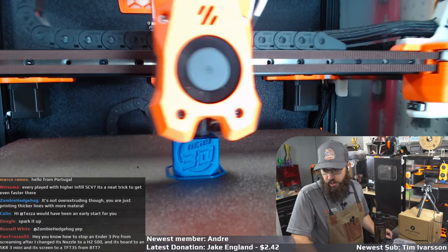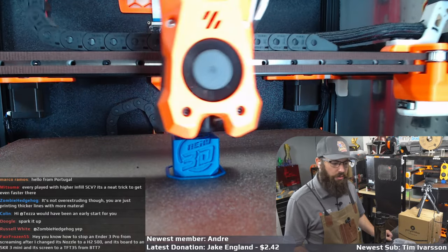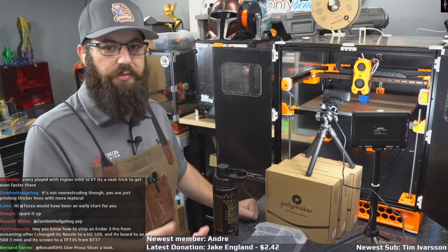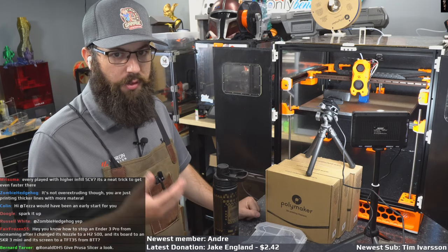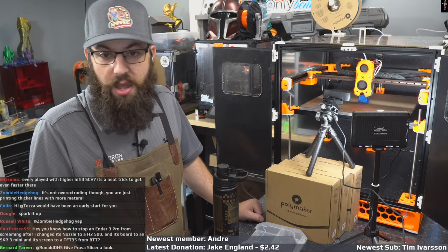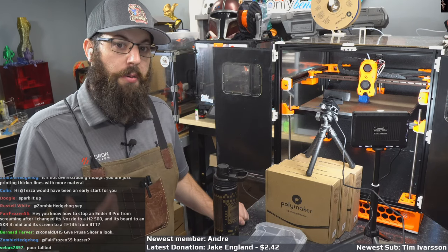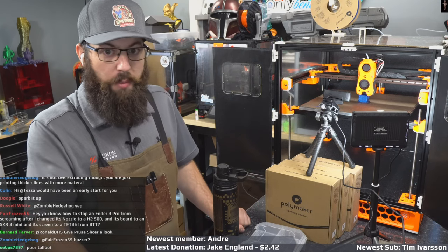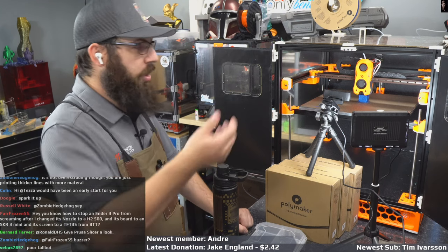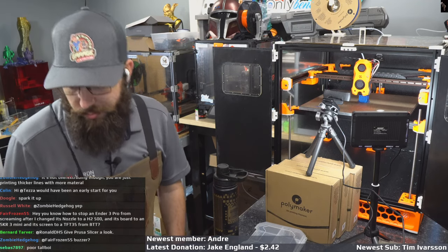You're just printing thicker lines with more material. That is over extruding. You're pushing more filament through the nozzle. Well, either way, terminology then. I want to push more filament through when I'm doing infill, so I have to do less travel moves. Overflowing, I guess you could say, but I'm over extruding. I'm pushing more filament through than normal. I view that as a term called over extrusion. I mean, like, we call bed flingers Cartesian printers. That's not the right way to call them, but that's what we call them. So,